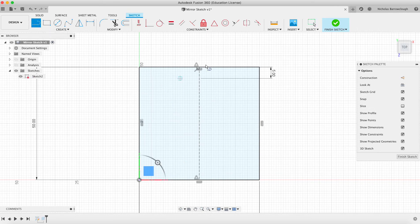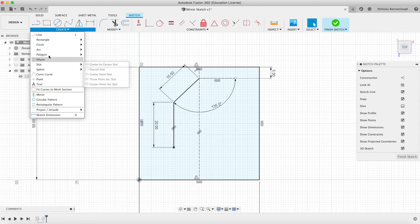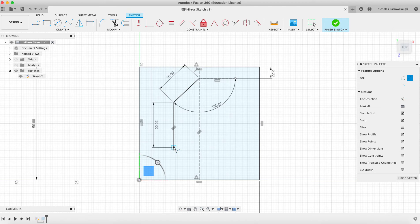I'm going to draw a profile on this side that I'll then replicate on the other side. We'll start from here and come back at an angle — let's go to 135 degrees and 15 millimeters. We have proper constraints to our sketch, which is always useful and important for editing things later. We'll come down here by 20 and create a curve — a three-point arc. We'll go from here, set this point, and arc it back that way.